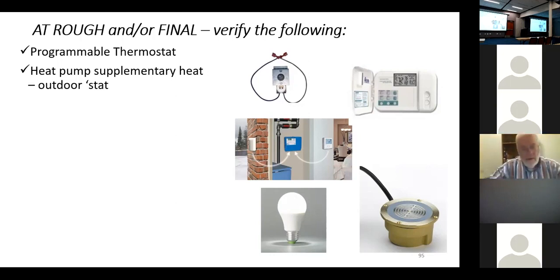Now, these are great questions, and I'll just touch on it. Let me finish up with the air-to-air heat pump, and then we'll go to the ground source. The air-to-air heat pump takes heat from the outside air, and like you say, they're getting better now. There's heat in the air even at very low temperatures. You have really low evaporation temperatures, and because of that, you can absorb heat out of 10-degree air.